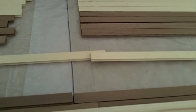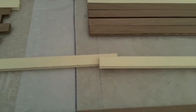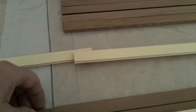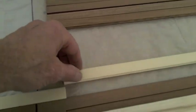And to facilitate some strength along with that, we have marked lines on our worktop about 1.5 inches apart. So each subsequent set of strips will be offset about 1.5 inches from the other. So while we're doing a butt joint, we're actually doing a staggered butt joint, which will give us substantially more strength. Of course, once it's glassed and mounted on the board, the strength is really not a particular issue, although just to be safe, the intent is to place this butt joint over the number 6 bulkhead on the board.